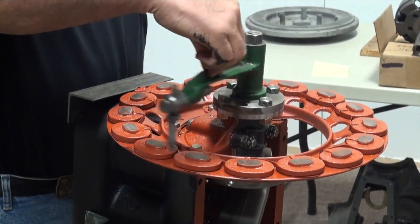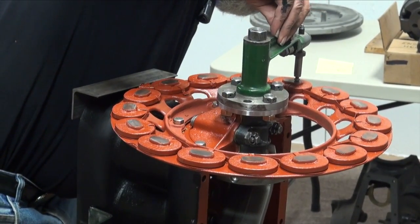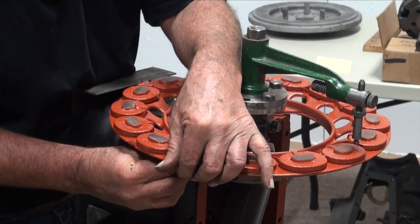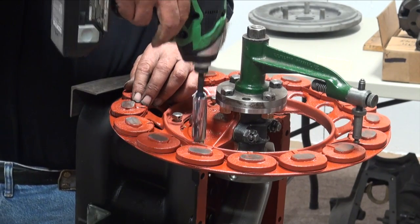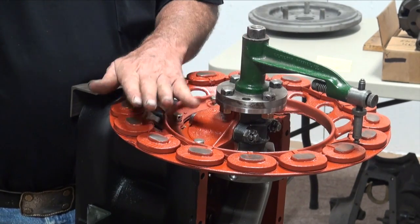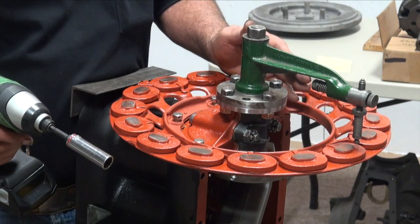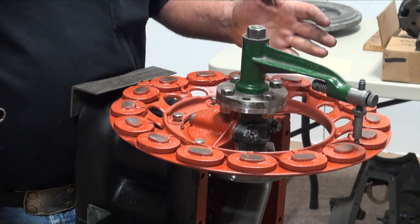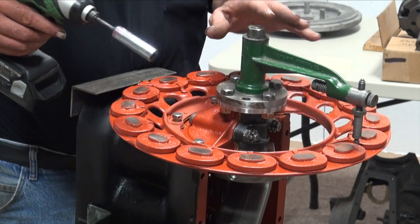We're still touching a little bit on that side. We'll take off a little more. We removed a couple more shims off of that side. All we're doing is trying to get it square. We'll set the flywheel on it and measure what our gap is — we may have to raise or lower the whole thing. If we're tight by 10, we'll remove 10 thousandths worth of shims off all of them. We're just trying to true it up.